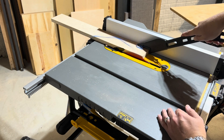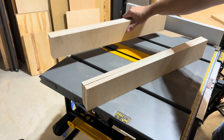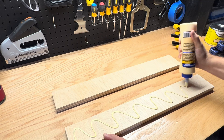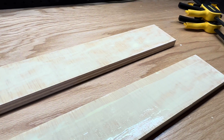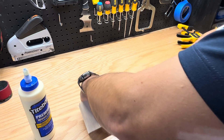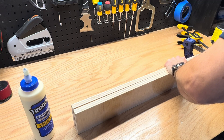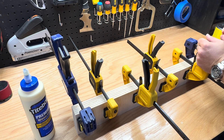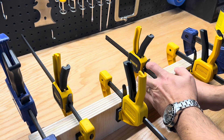Plywood is a good selection as it's less likely to warp and change shape over time. Double up two pieces for the front fence and two pieces for the rear fence, then glue up the doubled plywood for each. Ensure the two pieces are flush with each other on all sides and clamp them up. I prefer to put on all the clamps before tightening them all the way down, and once I confirm all sides are flush then fully tighten each clamp. Try to clean up any glue squeeze out now to minimize the amount after it's dry, then move to the next step to allow for cure time.